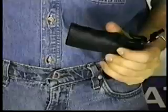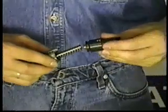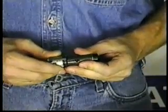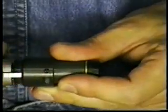When assembling the hammer, spring, and bolt, keep the spring centered around the guide tube. Line up the hole in the bolt with the sear on the hammer. When this assembly is put into the sleeve, the hole will already be aligned in the sleeve slot. Then attach the piston shaft into the hole and slide the assembly forward. When putting the sleeve onto the piston shaft, put your finger over the end of the assembly to prevent the bolt and hammer from falling out.